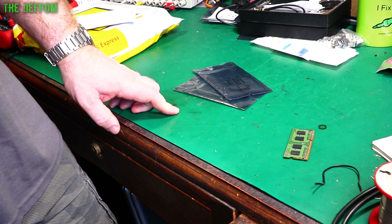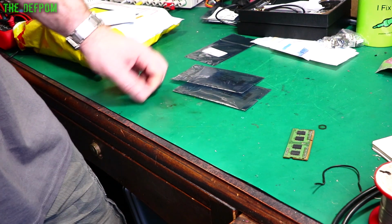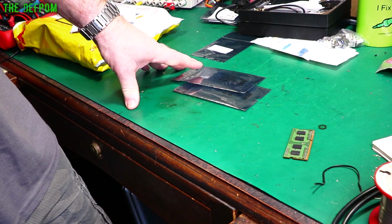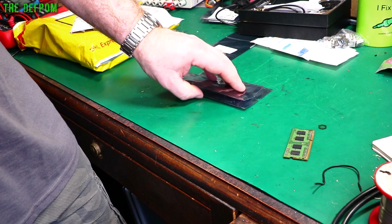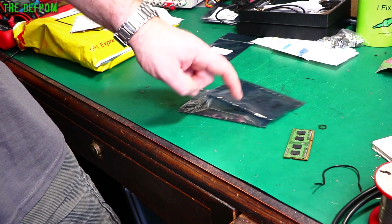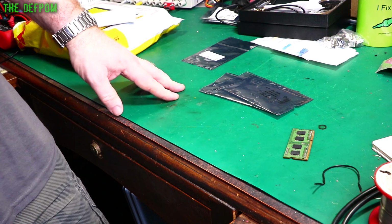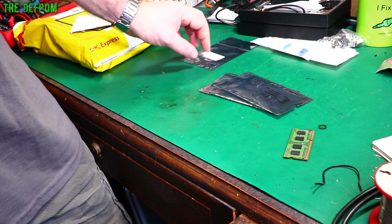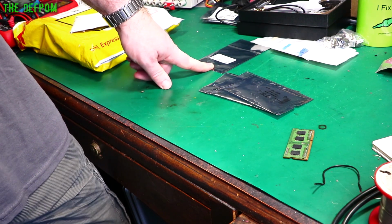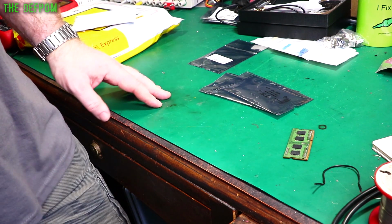Now the op amps I purchased recently, which are here, the OP177 and this other one that's just arrived. One of those still has offsets, but it's got better precision, and one doesn't have an offset option, but it's really high precision. So these are better quality. I think maybe that is the better one there with no offsets on it. This had high precision op amp, but it still has offsets, I believe. And I was going to just give them a go and see how they worked, because if they work well, that might be worth doing. But I think one of them was like $15 for each one or something like that. It's a horrendous price. So I think it was this one here was the more expensive one. But if I can do it without having to use a trimmer and it just works, then that'd be great. But you've got to keep your options open.